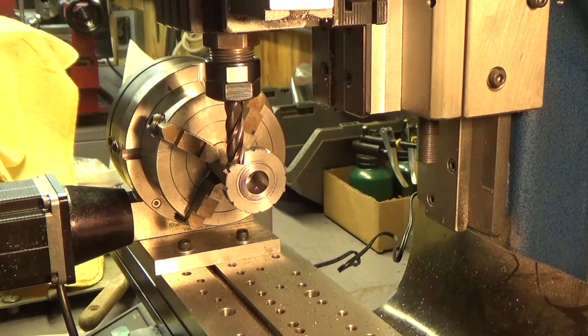I'm guessing the original is probably about an inch and three-quarters, 1.7, something to that effect. So it'd be 1.25 times larger than this. The original star wheel has 12 points on it, so that's what I'm making this one. The first one I made that I've been using on the shaper is 10 teeth.